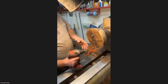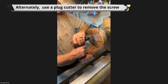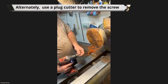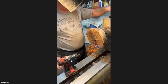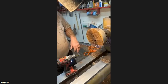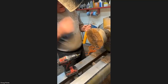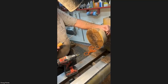Yeah, you do, because I showed you some last time I did a demo making jewelry. That's what I used to make the small earring pieces. It's what they use to cover screws with when you do flat work. Well, I'll have to Google it and then I'll go, oh yeah, that's what he's talking about. So it cuts little round plugs is what it does, Doug. Oh, and you're gonna go over it and cut around it that way. Exactly, and then you just snap it off and pull it out. Yeah, there you go. So there's another method.